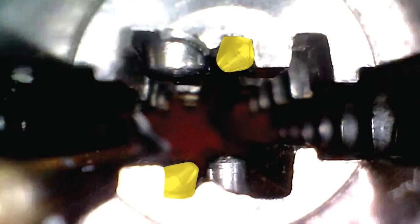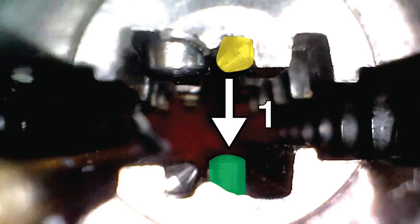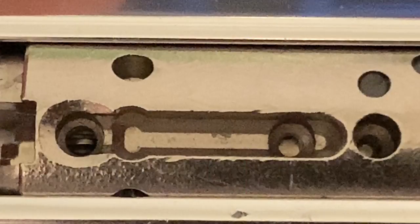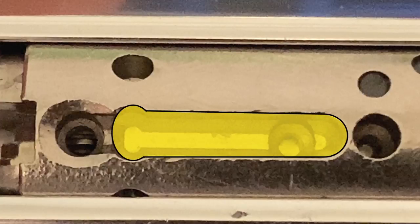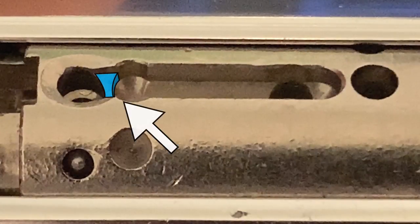In this rear view of the lock, you can see the two pieces of warding — now shown in yellow — which each push one ring in opposite directions to engage with their respective pins, highlighted in green. The first ring is pushed down to set the sidebar element. The unique sidebar system is found on the bottom of the plug in a specialized groove. The groove has two sections: one for the sidebar and the other for a specialized keypin, separated by an elevated border.